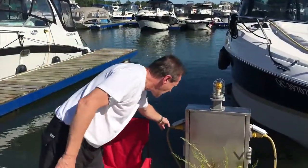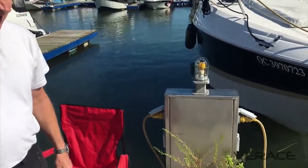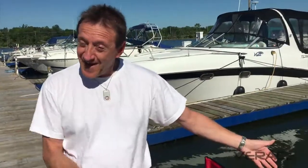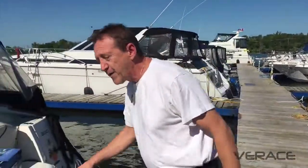We'll start off with the electrical — just a couple of tips. You've got 110 coming out of the electrical panel from the marina, and usually that is pretty dirty power. This new digital charger has regulating technology built in that will clean up the signal. For those of you with boats at a marina, the power on one cord is theoretically good for 15 to 20 amps, but in reality you could probably get 30 amps because the breakers are corroded and won't pop. You could go up to 40 amps before they pop — you'll probably melt your wire before they actually pop. Keep that in mind when hooking up your boat.